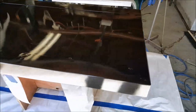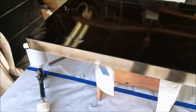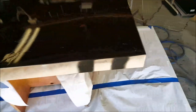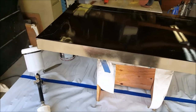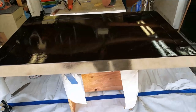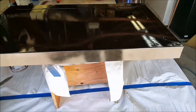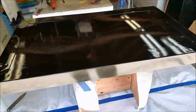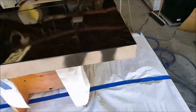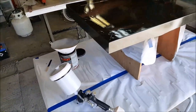That's a nice first coat. I'll let that dry for maybe half an hour before I hit it again because of the type of paint that it is. Remember the truck cap video? I fiddled with this gun non-stop. I'm running 20 PSI, one open on the fan — it seems like once you hit one open, the rest of the knob doesn't really do anything — and one and a half turns open on the fluid. That laid down pretty nice, running about 50% overlap. Come back in about half an hour and hit it again.